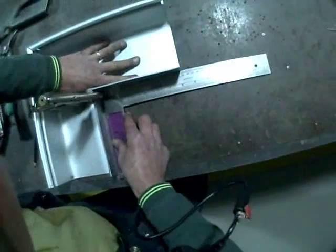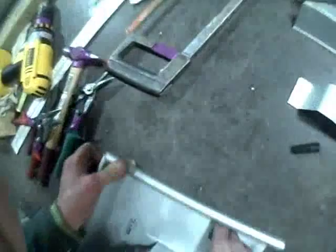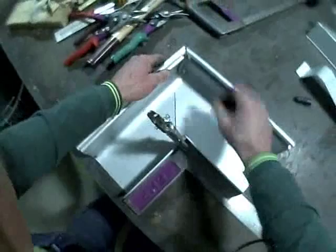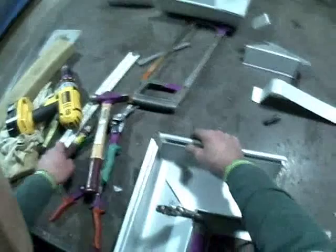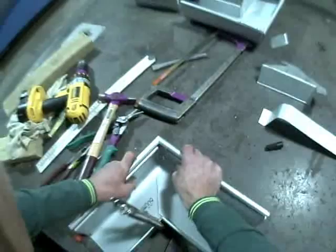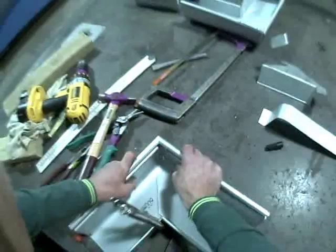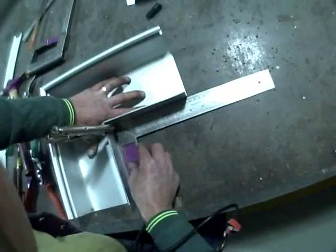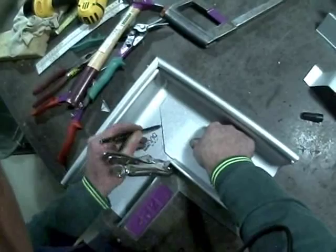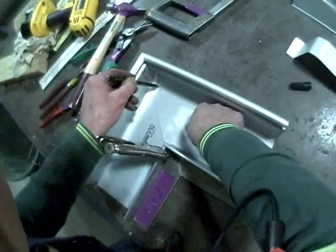You can sit them together with the aid of some locking pliers — it acts like another pair of hands and also protects our hands from getting drilled. Cramp that together, making sure they're tight. Push down on the spout so the bottoms are joining up. Now we can put the spout around and have a look — make sure that it's square, re-check all your angles. I can see I've missed a little bit of material in that corner, which is going to stop the bead from joining together. I'll use the pliers to pull that around a bit further so it's not in the way. Now when the beads go together, they're very neat — we'll get a beautiful job out of that. Always checking for square, because the houses are built square. Along the bottom edge of the spout where it's folded is the most accurate point to check. Pull the spouting around until it's right on square and apply a light bit of pressure so it doesn't move. You can put a little line down here so the spouting stays in the right spot — it also gives you a line to silicone to later.